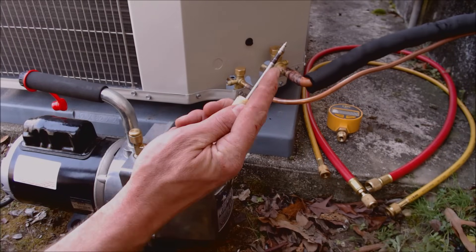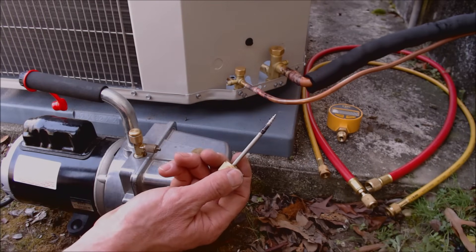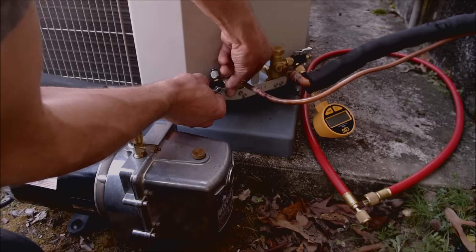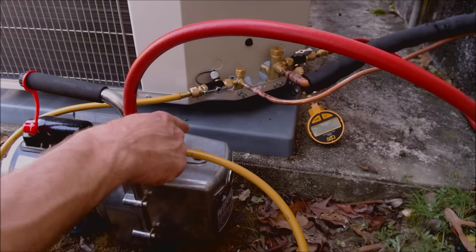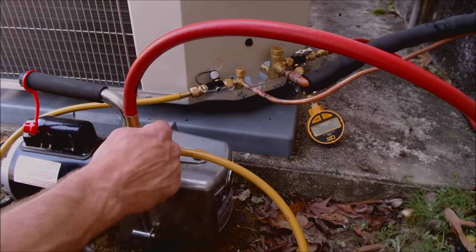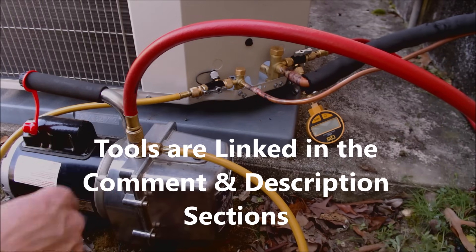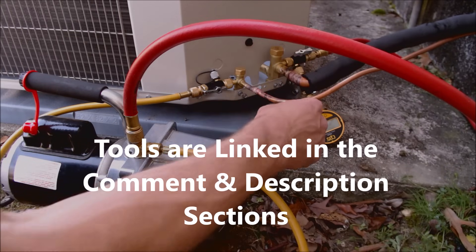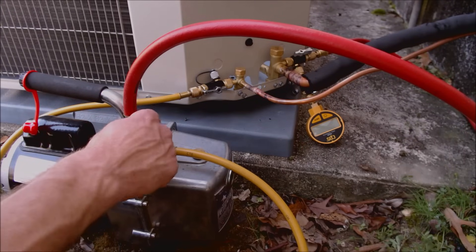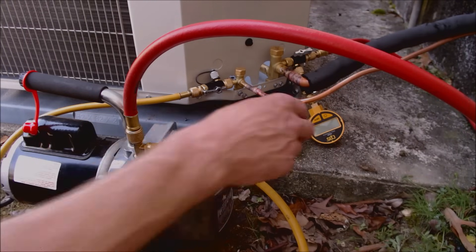One thing I want you to know is that I don't put the valve cores back in until I have positive pressure in the system — that way I know I don't lose my vacuum. Now we're ready to turn this system on. This vacuum pump does not come equipped with a gas ballast. The more expensive vacuum pumps come with this, but I use this and I have very good success with this 6 CFM vacuum pump. I have this linked in the description below, along with the valve core removal tools and the micron gauge. Normally if it has a gas ballast, you open it, turn the pump on, then close it down. In this case we're just going to go ahead and turn the vacuum pump on and make sure our micron gauge is on.